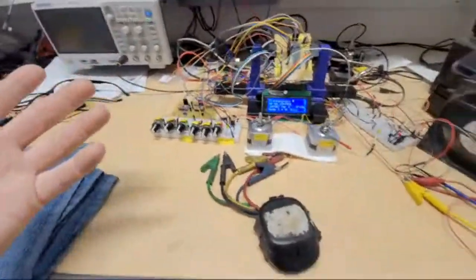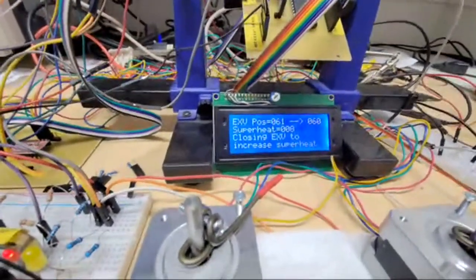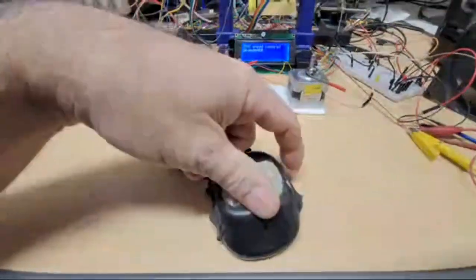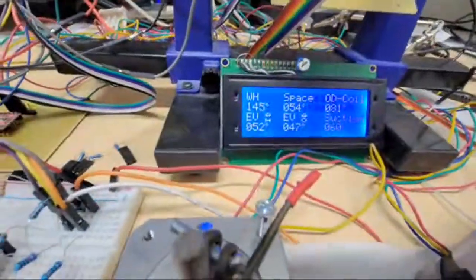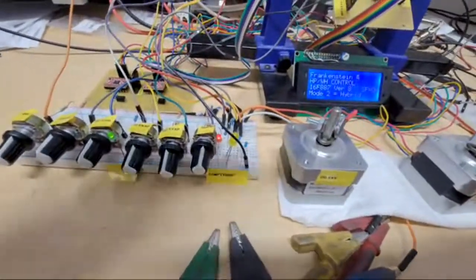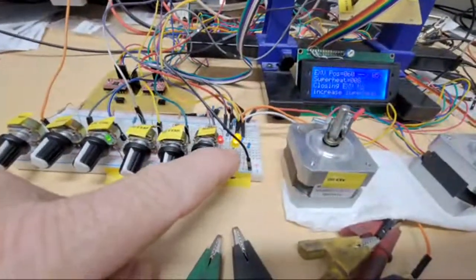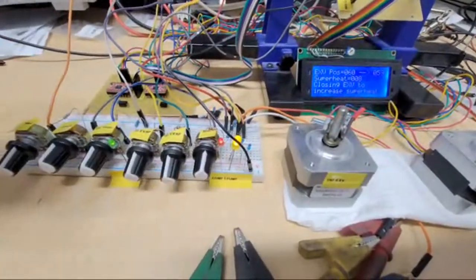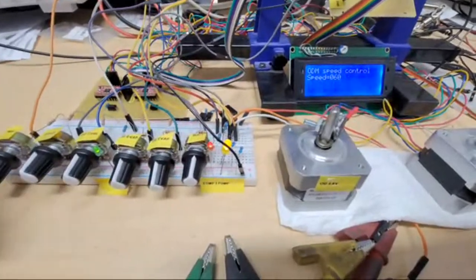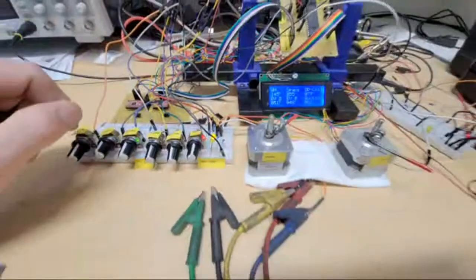So the simplest thing is, it's in mode 3. I made all these different modes, right? Mode 3 is AC only. So if I switch the water heater on, there's only one difference it's going to do. I'm going to keep this here so you can see the LEDs, but it's going to go mode 2 hybrid now. And when it does switch, whoop, there goes a pump. That's the only difference from AC only to hybrid, is that you're turning on the pump and you're going to start rejecting heat in the water heater.